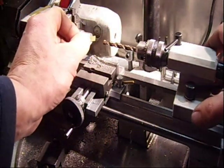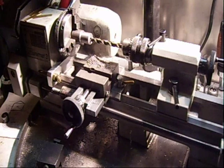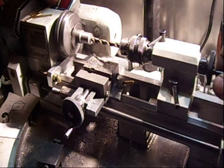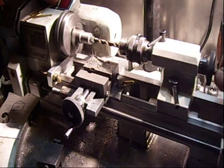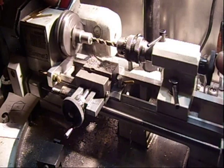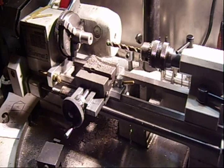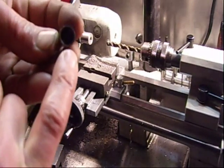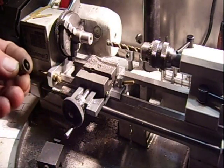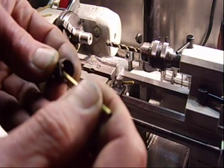I change the drill now. I set my head back, set it here on my counter on zero. These are very thin plates. I'm still a little bit on the safe side. Actually, 10 turns is 10 millimeters — three, four, five, six, seven, eight, nine, ten. Okay, and actually the rest I will mill out because this is a casting, but I can do the beginning of this side till here. This I can make on the other lathe and the rest must be milled out.